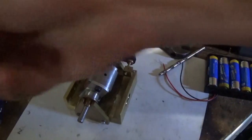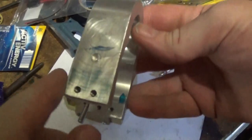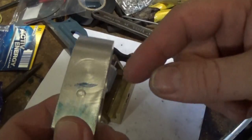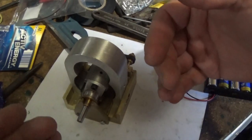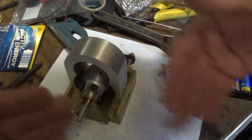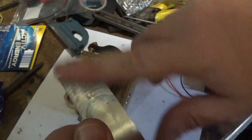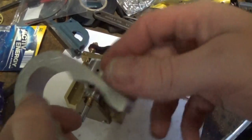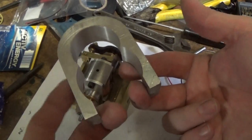What we need to do is hollow this out to fit the magnet in there, just under flush, and I'm going to epoxy them in. With these magnets just sitting on here with electrical tape around it, it will run, but they hammer backwards and forwards and stretch the electrical tape — four or five layers of it — so there's a fair bit of force on them. I figure if they can't move, that would be better. I'm going to epoxy them in and file them all up flush, and then we're going to make a couple of little brass plates to go on here, one on each side with a couple of screws, just to stop them moving or dislocating or coming adrift. That's the plan.